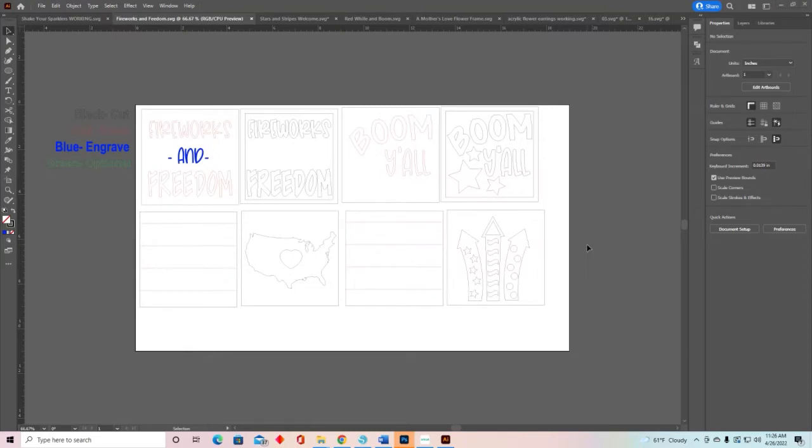The last one is engrave, and that is this darker area. Where it says 'and,' that is actually engraved into the wood — it's a deeper cut. It has a little bit of a burn mark around it. That's what engrave does. That is your fill color. So that is why the SVG files don't have any fill in them — because if I were to fill this block in, it would want to engrave that whole thing, which is not necessary. Just the word 'and.'